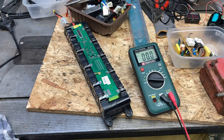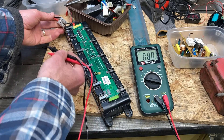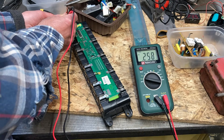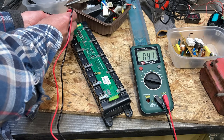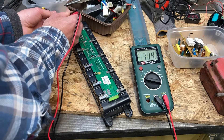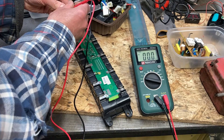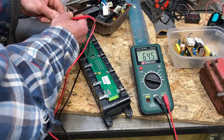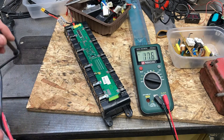We'll turn the multimeter on to voltage and first thing I'll do is put it on up here, negative and positive. I'm getting nothing out of it - I should be getting something. It's only giving me millivolts and they're jumping all around - that's not right.